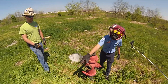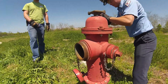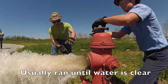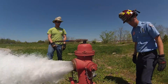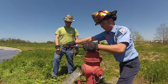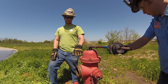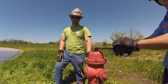He's going to spin it counterclockwise until we get a pretty steady flow. We're flushing most of the stuff that's been built up on the inside of the stem. We're going to let it run for a few seconds to make sure we get everything out for our test. This is a very important step whenever we're testing hydrants — we want to make sure there's nothing that could restrict the flow so we can have accurate readings. We don't want to damage any of our equipment with dirt, mud, and stuff that can get caught up in these hydrants, especially since they haven't been used very frequently, if at all, since they've been installed.